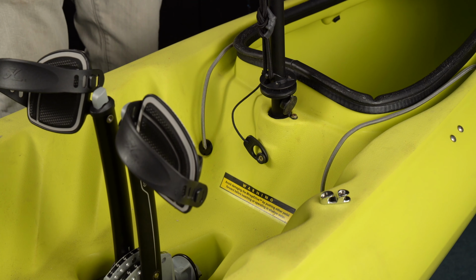This is the bungee from our furler. I'll hook that on. In order to run your cargo bungee back through here, I'll show you how to take this hook off and reinstall it. You could use a little pick to reach inside there and grab that bungee, but if you just usually push from the back, so I push from the back, get some slack here. Now take the slack, push it out the other way. And then from there I can pull this tail out.